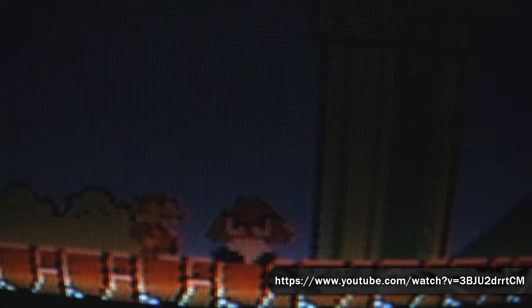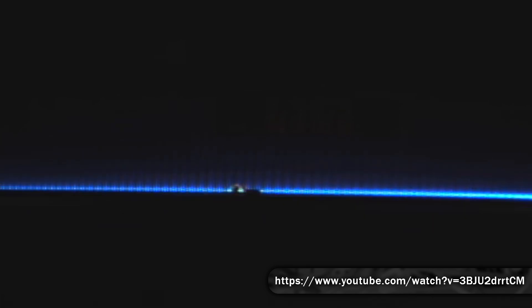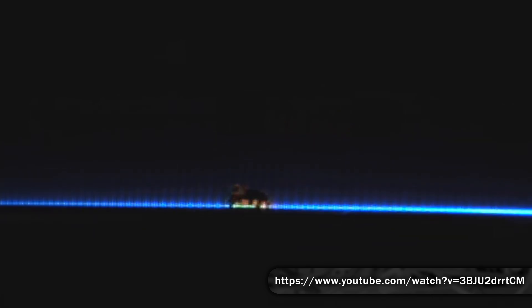If I slow the recording of the CRT down a little, you can start to see what I'm talking about. You can now see that the picture is being drawn from the top to the bottom, and on a PAL system this happens 50 times a second. Borrowing a small segment from the slo-mo guys, you can see this effect in more detail — here at 2500 frames per second, and now here again slowed to 146,000 frames per second. You can see how each line is made up.